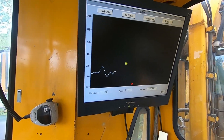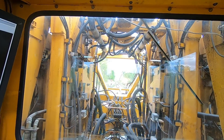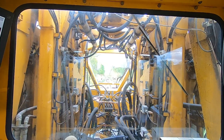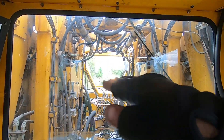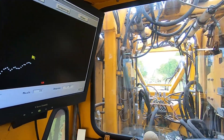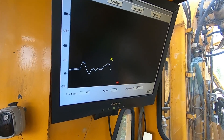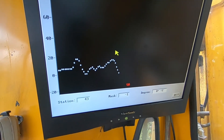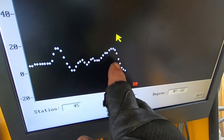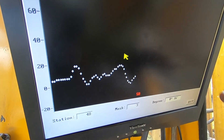We're going to try to smooth this up a little bit. If you watch your light carriage up there — see that's where that real bad inch and a half dip was — that's pretty much smoothed out. You can see the top of the light carriage up there, it's running pretty smooth on the track, so the cross level is real good. I just got to get this line straightened out. That's where that dip was — see this line's going down here — so we're going to have to smooth this up.